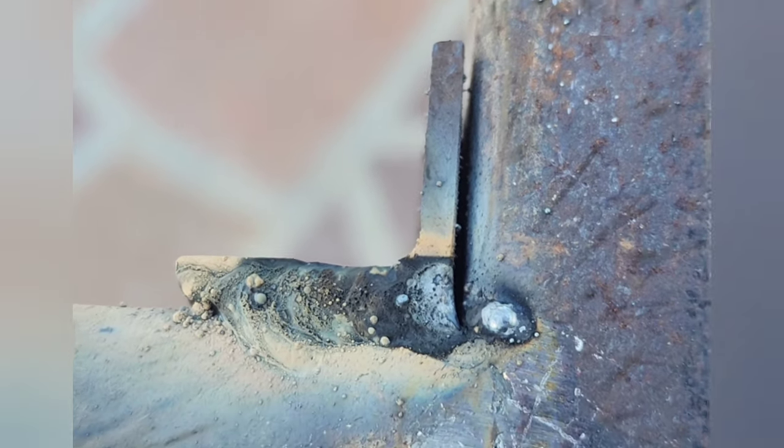Now I build three-quarter-inch angle iron all around it so those tiles stay in place and are tight. One of the tiles is moving around so I'm going to put high-heat caulking around it. I put high-heat caulking all around it so it is airtight. Now we're going to put the insulation. My helper is here — keep an eye on them, they are very curious. Now I weld a little flat piece on the front and also weld the drum to the angle so that way if somebody touches it, it doesn't break or cause any problem.